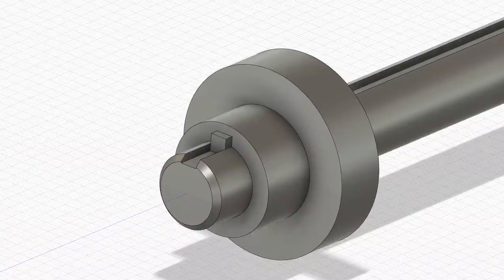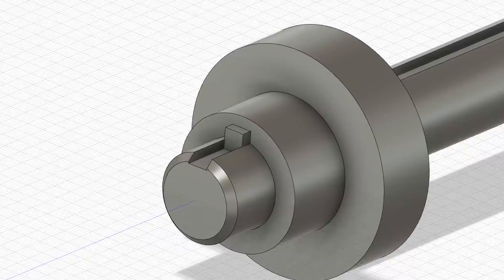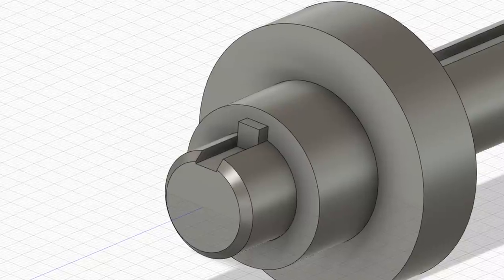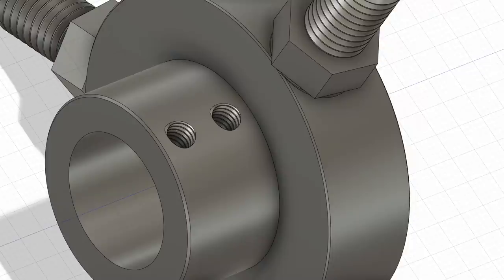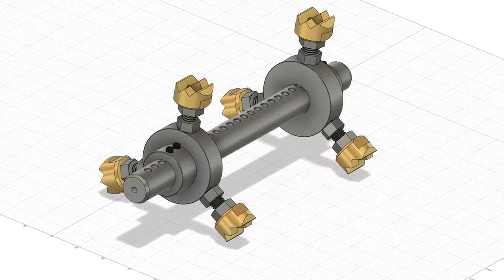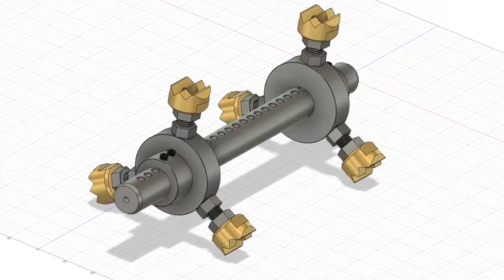The original plan was to have a central 25mm shaft with a keyway slot and some way of locking sliding collars with telescopic jaws in place. That idea was ditched as I really wanted the fixing to be solid axially and rotationally. A set of spot drilled holes at 10mm intervals to match up with steel grub screws in the collars seemed to be a reasonable solution. I ran up a quick animated view of the CAD design and used that to make some tweaks. When I say some tweaks, this is version 19.